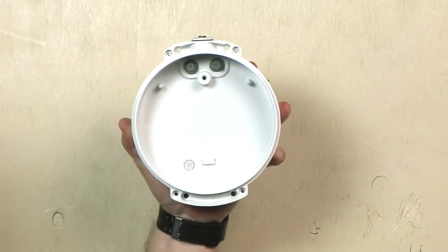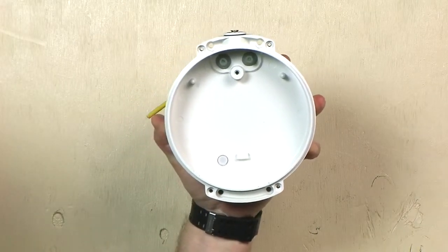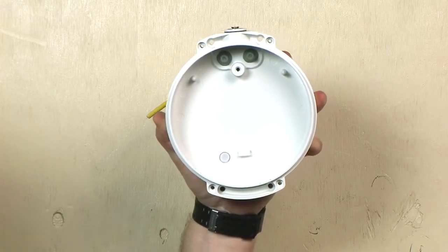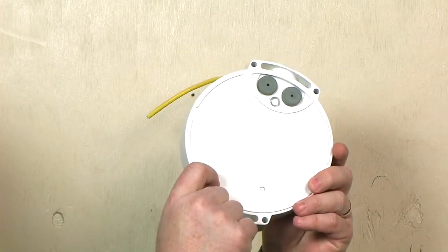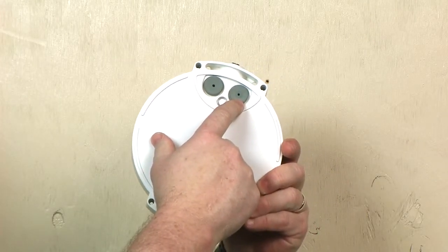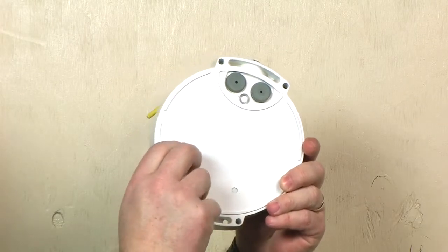This enclosure is a fully sealed IP66-rated enclosure that is also vandal-resistant. It is designed so that there are no openings for moisture to enter the inner enclosure. All mounting perforations are outside of the sealed area of the enclosure. The wire grommets on the back are sealed until perforated by the installer. The integrity of these seals is essential in order to keep moisture from entering the enclosure.